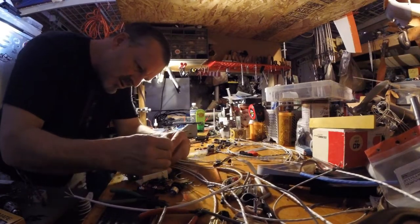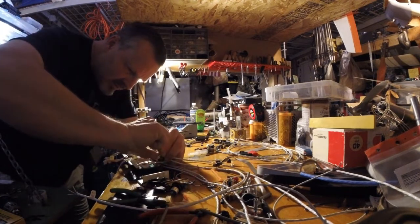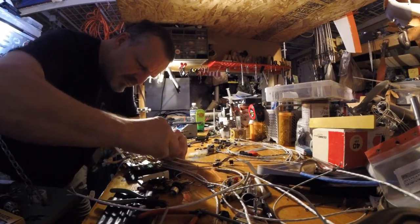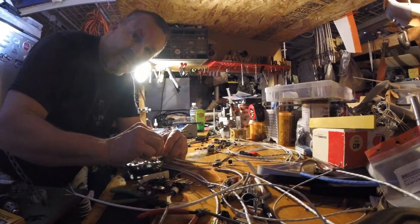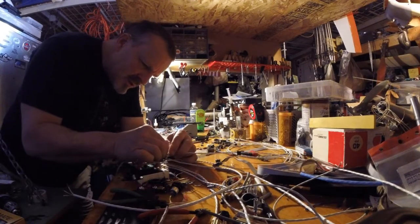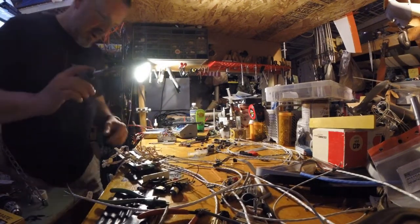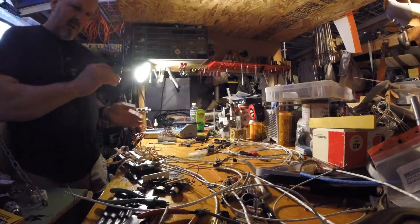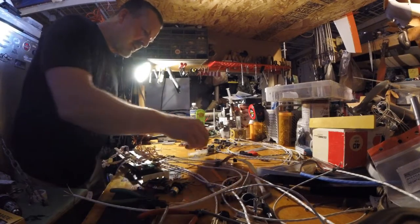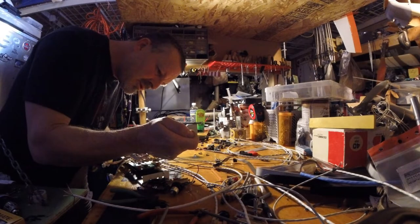At least I can kind of guarantee this thing is not going to come apart. I did find all the switch positions, all the wiring going up to that, that the yellow strands on the switch positions were all tied together. And what happened is the individual position on the chip reads that particular position, whether the positive or negative going through that particular side is then going to be read as either a positive or negative condition, which determines which position the switch is in.